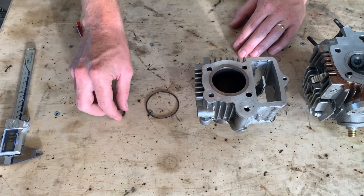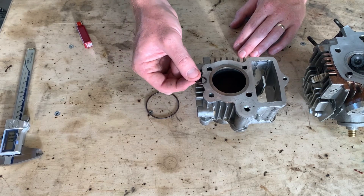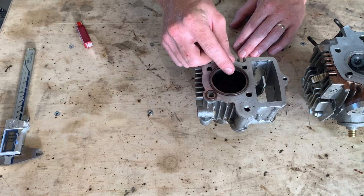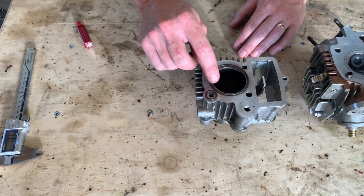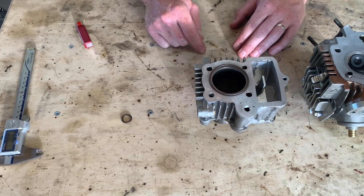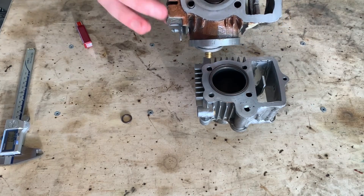I've also got a two and a half millimeter o-ring — I got it in this size because it was cheaper. If there's enough room, I will place this o-ring here to seal up the stud which provides pressurized oil to the cylinder head. If there's not going to be enough clearance, I won't worry about it, because the tunnel area is going to be sealed with some high temperature RTV. I'm going to do away with the copper spray as it's a bit messy and I don't think it seals as well as the RTV.